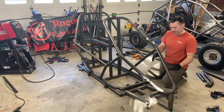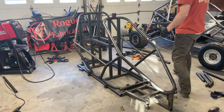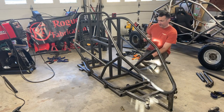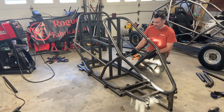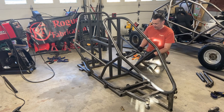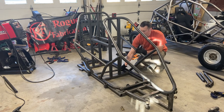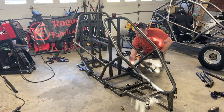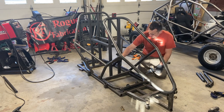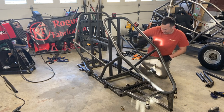The order of building reflects using those cross members to help align things. Looking at the diagram and your master parts list, part C44 is your main floor cross member — it has an exact width between the two floor rails. Since you use the jig to assemble it, this piece will fit here snugly. You can also make a second one, trim it down a little shorter, and use it as a reference. If you have two points across from each other, put a square on it, and if that's square where those two points meet, then the whole assembly is square.